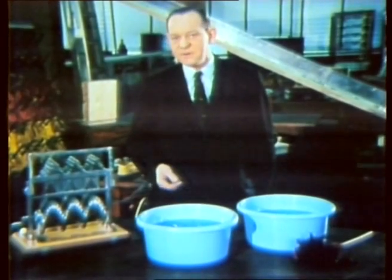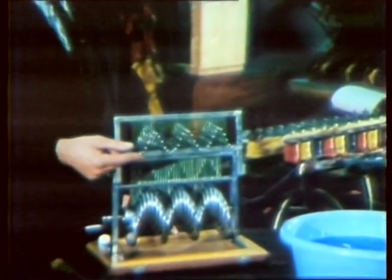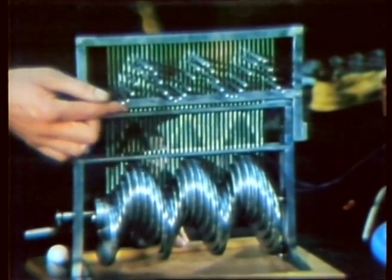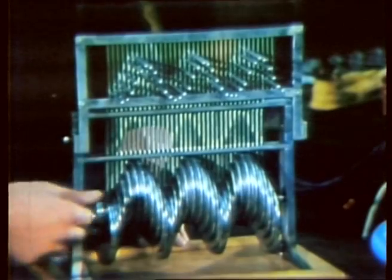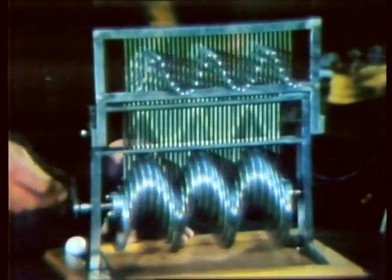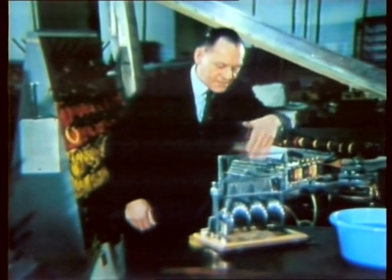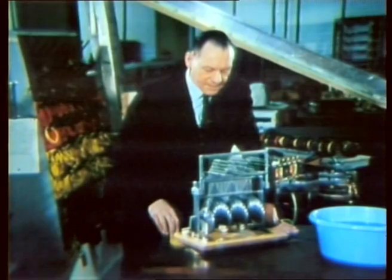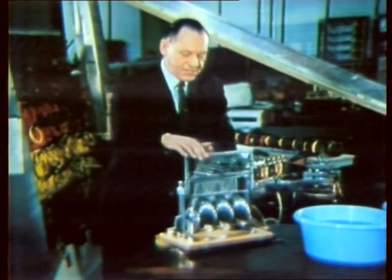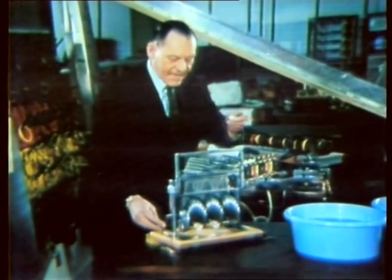Now we must examine this wave motion in more detail, and we're going to do it this time by means of a purely mechanical model. Each of these rods is free to move up and down, and they can only move up and down. I'm going to make them do such movement by means of a series of cams on a common shaft. When I turn the handle, something very interesting happens. Now this travelling wave pattern that moves along the top of this rod model is almost identical to the pattern of magnetic field which you get travelling over the surface of a linear induction motor. And in this stage, what travels horizontally is purely imaginary. To make it real, we have to add something else like this.